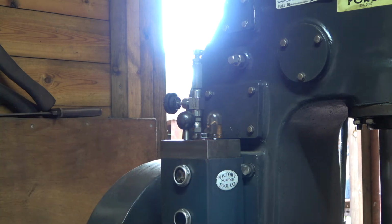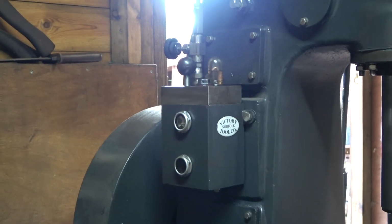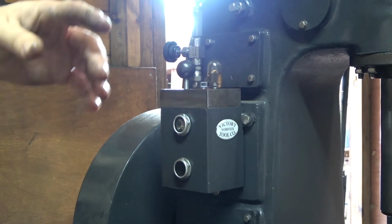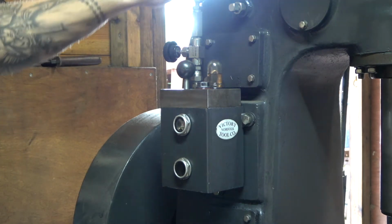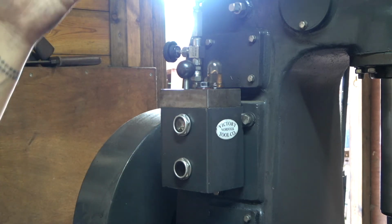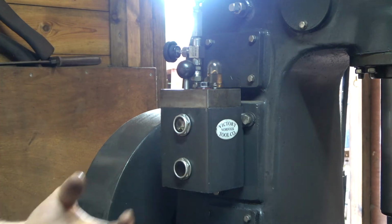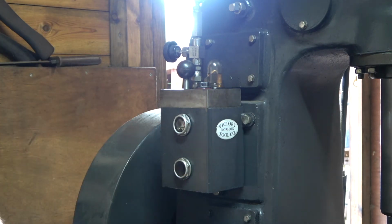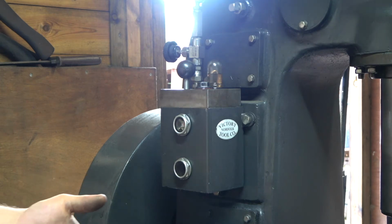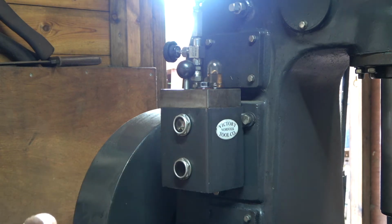it is absolute rubbish. I've struggled God knows how many times with it. I've even took it apart, but I spoke to Nige and he suggested, because he's had the trouble with some of his older hammers and some of the newer ones, he says the 15 kilos, because they're such a small hammer, the back pressure on the backstroke to draw it through isn't enough. So you need to thin the oil down a bit with a bit of thinners. Well, not thinners, I use white spirits to thin mine down. Or you can use whatever you want. Anything just to thin the oil slightly to a consistency of like air tool oil.